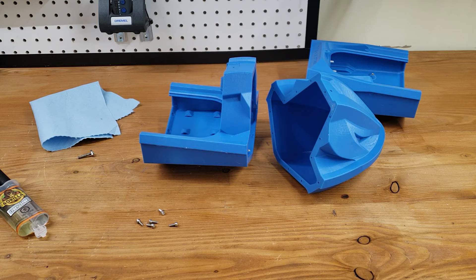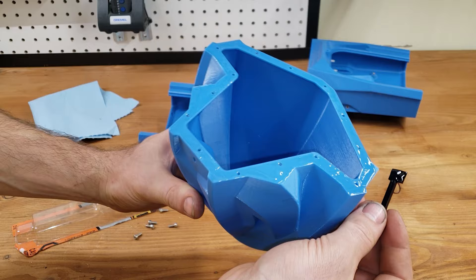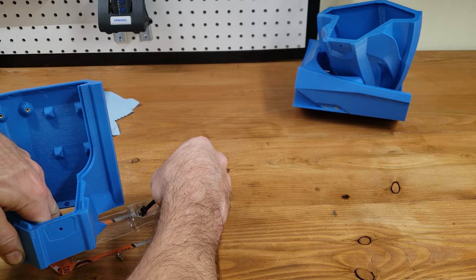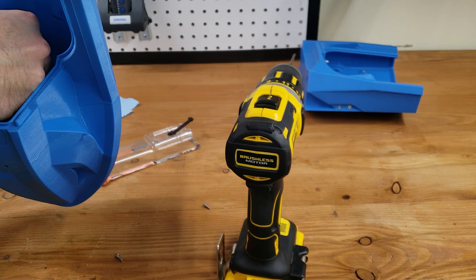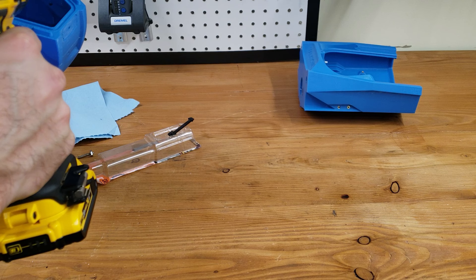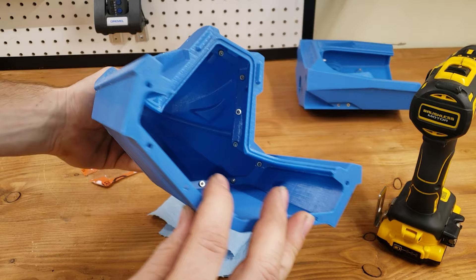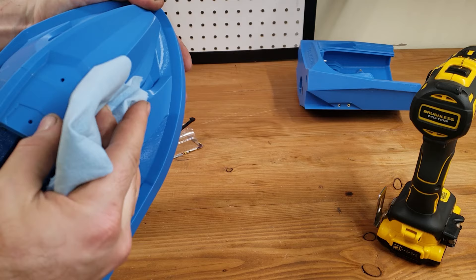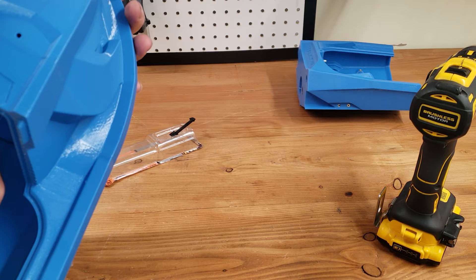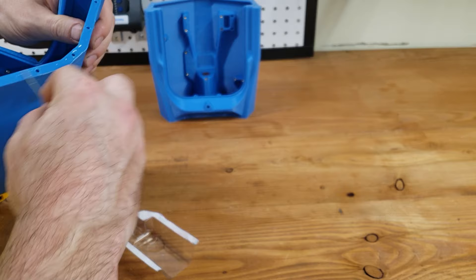The best way to apply it is to make a very thin coat on both surfaces and then press them together — you want as little material as possible while making sure you have complete coverage. It took me roughly three minutes to apply on both surfaces and another four minutes to put all the screws in, so you can see how tight the time is. Having a drill with some extension on the hex driver is gonna be a huge time saver — just make sure you have it set up before you start to glue. It might be a good idea to have somebody else help you as well. Once all the screws are in, take your towel and wipe out all the excess both outside and inside. Once you're done you can start working on the rear section, repeating all the same steps — though it's gonna be a bit more difficult to get all the screws in, so a ball driver is really gonna help you.